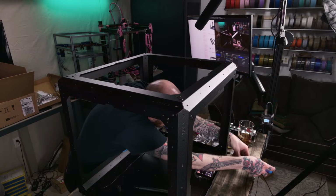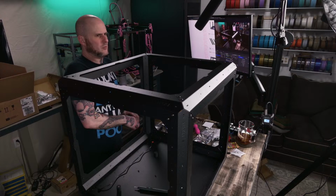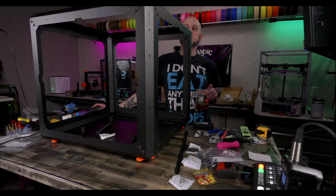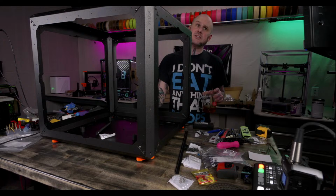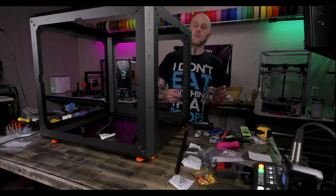All right. Good and tight. The matrix stuff was not working on touch input. Correct. On KlipperScreen on that machine, I can easily get the display to rotate, no problem. It's getting the touch input to rotate that doesn't work. I tried multiple modifications of config within Linux to make it happen. I tried adjusting the settings within the official documentation KlipperScreen recommends. I tried uninstalling and reinstalling Klipper entirely numerous times so I could fresh install KlipperScreen.